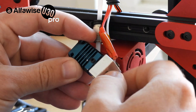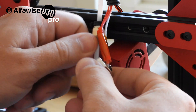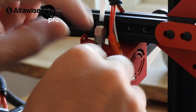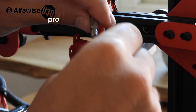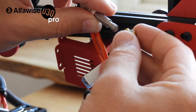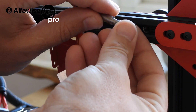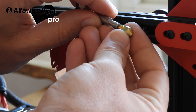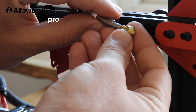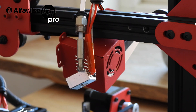The problem I want to show you is in the print head. It's very easy to disassemble, and as you can see, this piece has a smaller hole — so the Teflon tube doesn't go through it. That means the Teflon tube is not going to reach the nozzle, and it creates a gap. That's why we have bad print quality on the Alfawise U30, and it's not easy to fix just by finding settings.